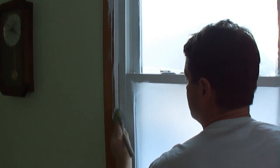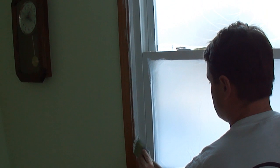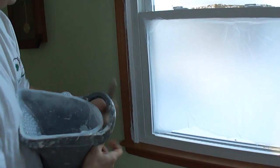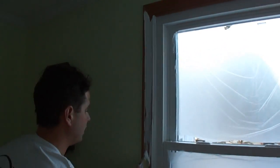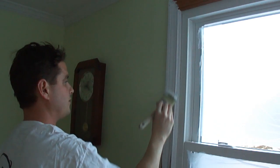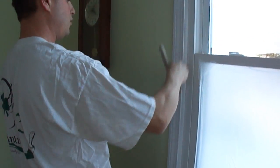I reload up again, come down, start here, load back up, come into it and bring it to the corner. I work it down in the corner and come up. I hit the inside corner there. Now I move the brush to my right hand, load up a lot, bring it into the middle and go down — spreading the paint around the surface. I'm using a 2½-inch brush here. Once it's all on, I feather it off, laying the brush down very easy and going down with it, working it into the corner.